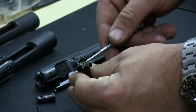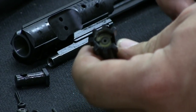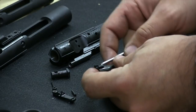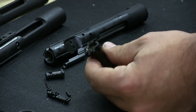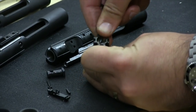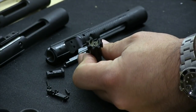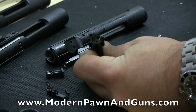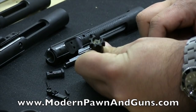The next part in there is the ejector. We generally don't completely disassemble the ejector — you need a tool that will compress it so that you can drive out this roll pin. All we're going to want to do is make sure that it's functioning: when I push on this, it does spring back out and it's not sucked all the way back in like it's jammed in the down position. We also want to make sure it's not jammed in the out position. We want to make sure that it is springing. It feels good — it's going to be pretty tight but movable.